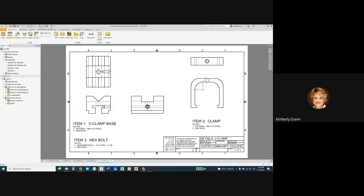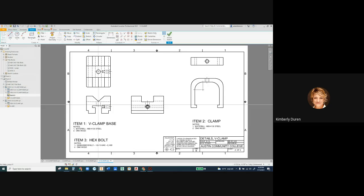I'm going to save that. Now we have some symmetry lines to add. Select the view first — I know it has symmetry — then start your sketch. Draw a line that goes beyond the view in each direction. I want it on the axis, so I'll project this edge and make it coincident with that endpoint. That sets it right in the middle. If this view moves, I don't want the symmetry lines moving with a different view, so I do this view by view. Finish the sketch.